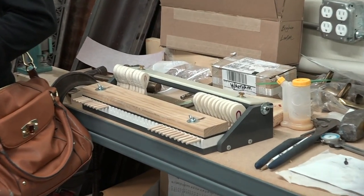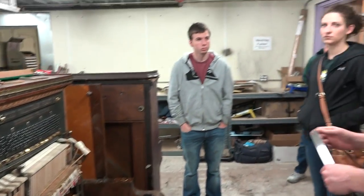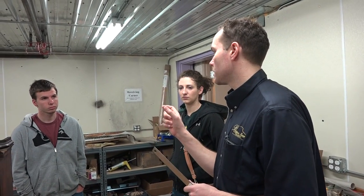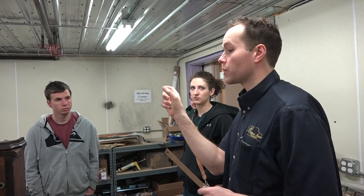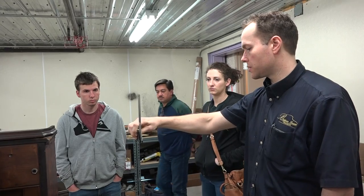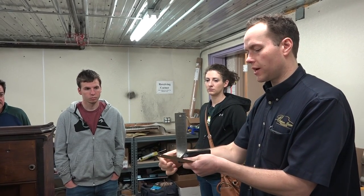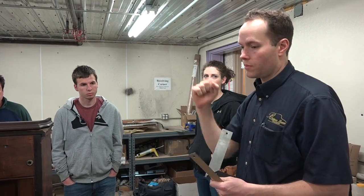Don, you already re-drilled all of these hammer butts — took them all out and re-drilled the holes. Re-drilling the hammer butts is kind of an art. Basically it's finding the exact spot in the vise on the drill press where every hammer goes, and you've got to memorize exactly where that hammer butt goes in depth so that it's the same for every hammer butt. Then set the depth gauge on the drill press so every hole is square — both dimensions at 90 degrees. The tilt on the table is 90 degrees, and the way you put the hammer butt in the vise is 90 degrees to the bit. The depth is set and you drill them out, so it's all exactly the same.